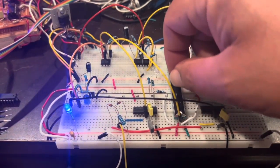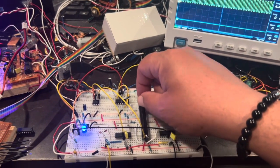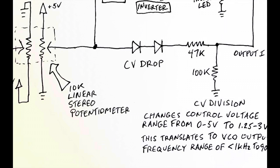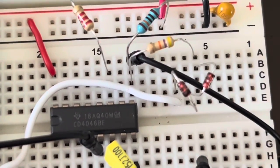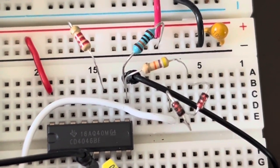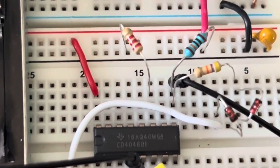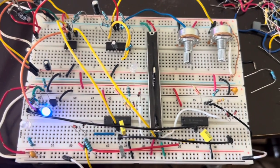While the interface is very smooth, on further playing around with it, the voltage sweep needed adjustment to better correspond to the desired frequencies. I added two diodes to decrease the voltage, changed to a 47K resistor and a 100K resistor to ground for a less harsh voltage divider, and changed the timing capacitor to a 2.2 nanofarad one. This gives a voltage sweep between 1.25 and 3 volts, which corresponds to a much better frequency sweep over a smaller area of excursion.